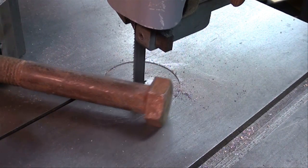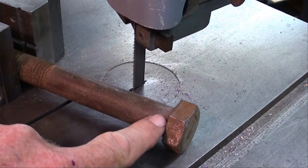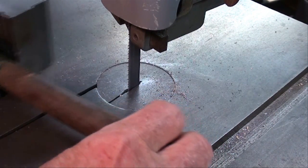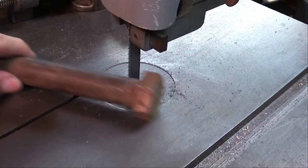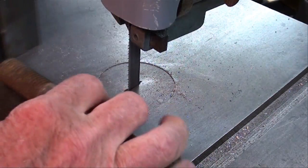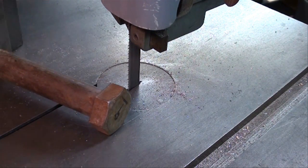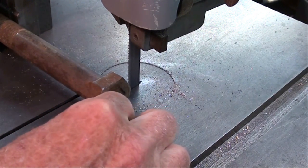If we were going to cut the head off of a big bolt and wanted it to be a straight cut rather than at an angle, just laying it in there will cut at an angle. Hold it in your vise and lift it up slightly so that the work is perfectly level, and then you can cut through.